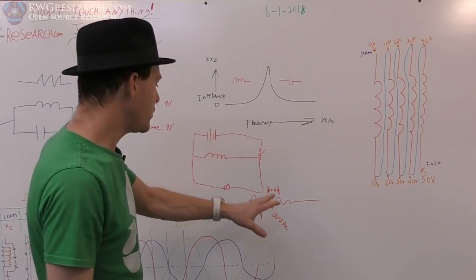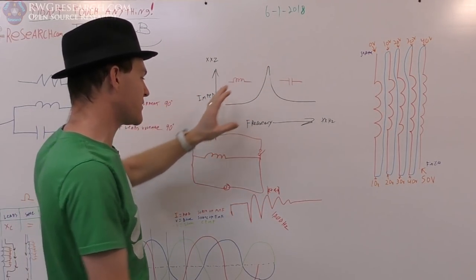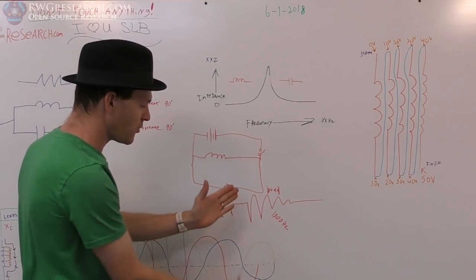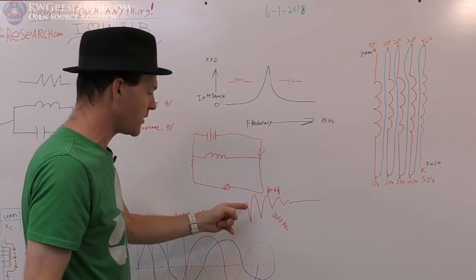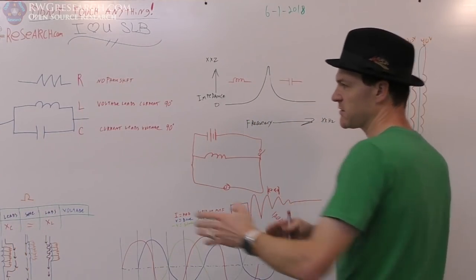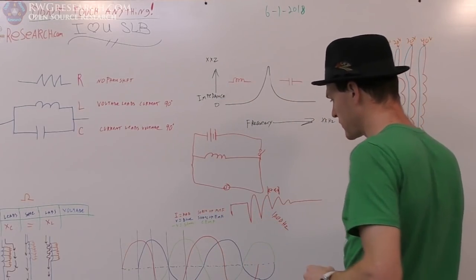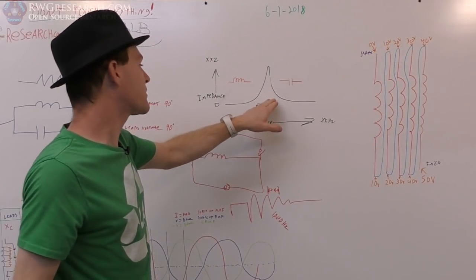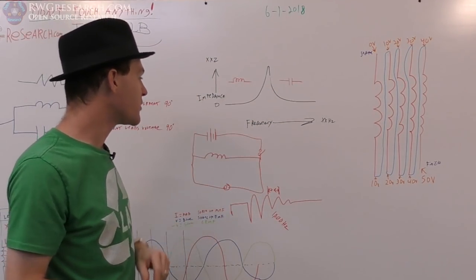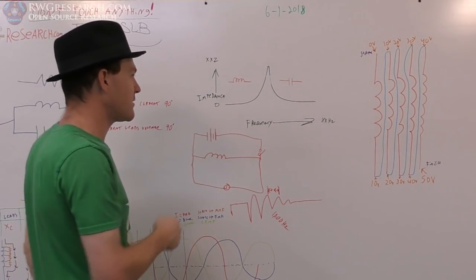So we're going to use the oscilloscope like this and the impedance analyzer like this to determine that we have what we are looking for. The scope and the ring test is going to give us our self-resonant frequency. Internally, this is happening. It's an oscillation between the two components. And then on the impedance analyzer, it's basically the same thing, but it's actually measuring how much gets through there. I don't know the details of how it's actually measuring that, but that's the curve we're going to get.